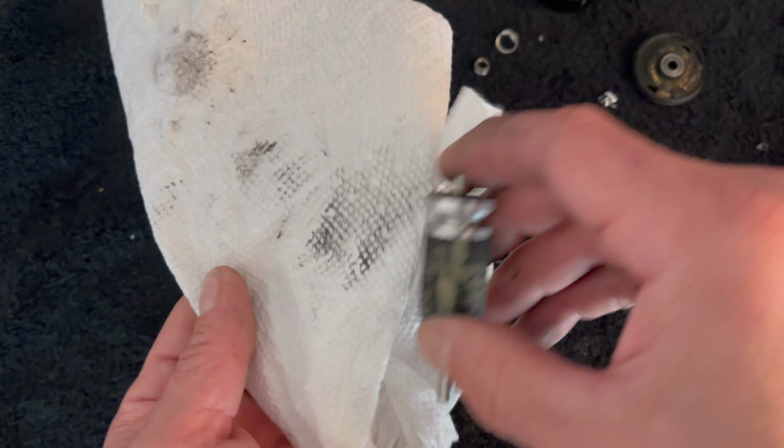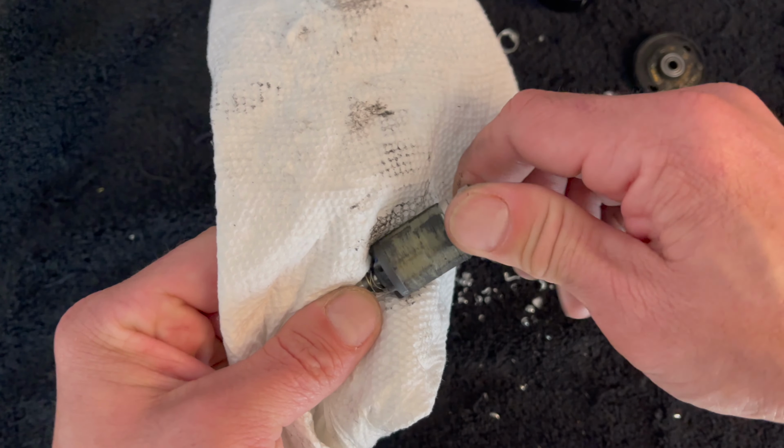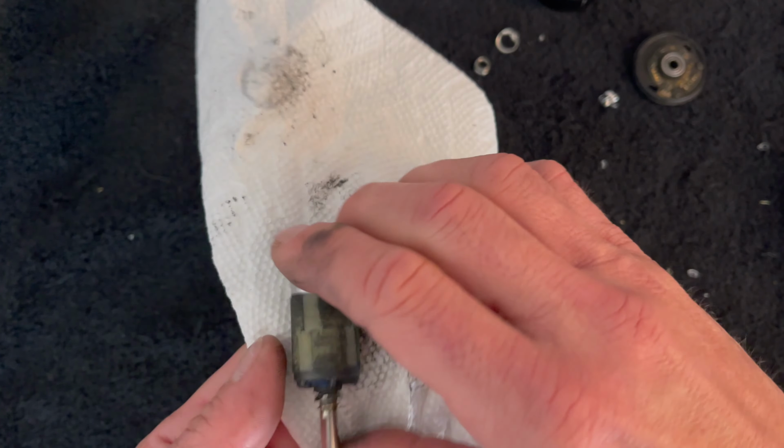The folks tear these apart and they ask us, well, where do the spacers go? They kind of only go on one way. All of your adjustment spacers go on this side, and they take the end plate out of the motor. You also got to check this rotor over very carefully for any bearing pieces stuck to it, because when that bearing exploded, they didn't catch it, and they kept driving the car around for a little bit, and that just circulates the parts into the motor.